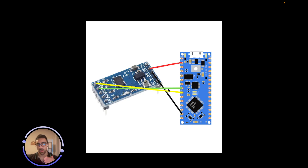If you are watching this video, you'll notice that I am using a two-sided version of the ADXL345. There are many different configurations of the ADXL345, but you can use any one — just make sure the respective pin connections are the same. We are using an Arduino Nano, so we will be using the Arduino IDE. As long as you're using any Arduino-based microcontroller, you should be good to go — just make sure you match the connections appropriately for your board.